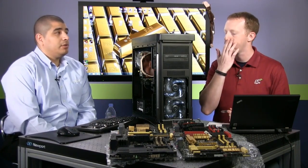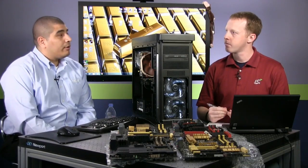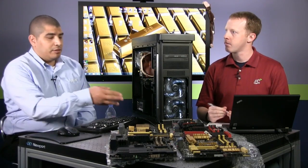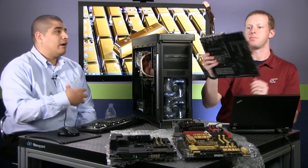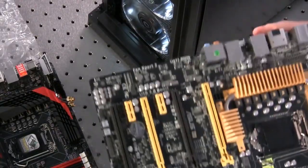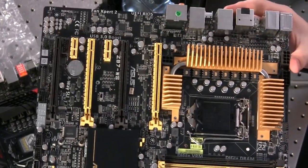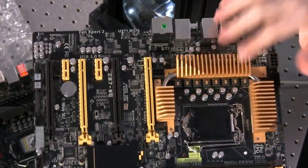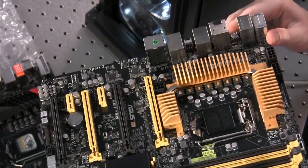There's a lot of confusion between what people understand to be the PWM and what gets largely encompassed as the VRM, right? The power components that you still have on the motherboard. So if you were to pick up a board, maybe Ryan, to reference the VRM power block section, for you guys who keep conscientious of what a VRM is made of, that's going to be things like your inductors or chokes, the MOSFETs and the drivers, and those capacitors. None of that is being integrated inside the CPU package.